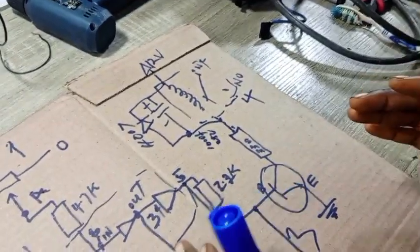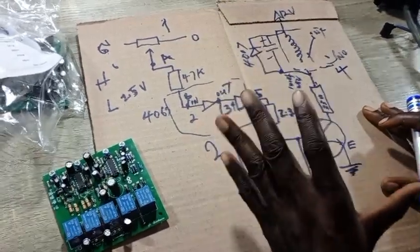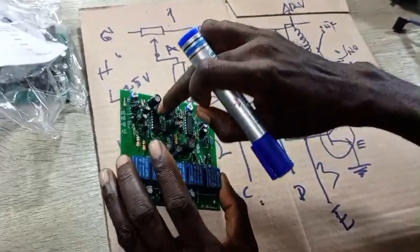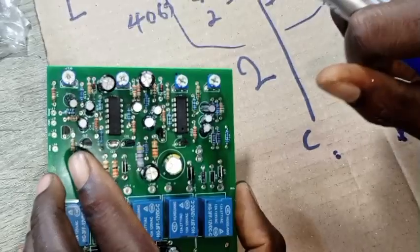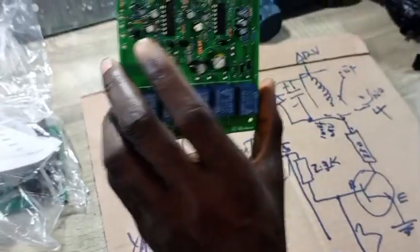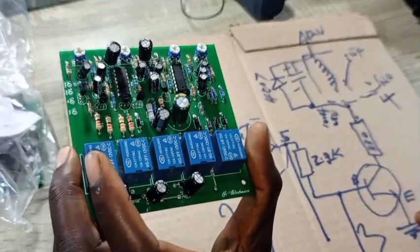For those fixing stabilizers or wanting to understand stabilizers, watch this video again and again so that you can understand your troubleshooting. Why I am explaining this is some people might understand all these things, but troubleshooting this particular place — especially when it comes to the IC — some give up. The IC is powered with a 6.2-volt Zener diode; I mentioned it in the previous video, so you can check the previous video. In the next video, I'm going to be fixing it into one of the stabilizers for you to see how this new board is fixed — in case you were able to get one, so that you don't have any issue fixing it. Subscribe to my YouTube channel for more.